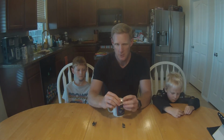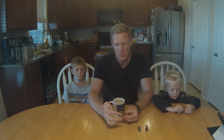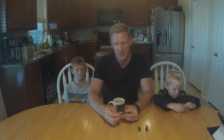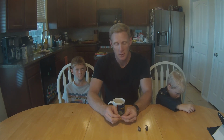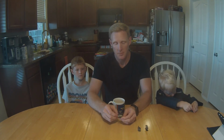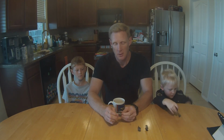So our first three we built like that. The next set that we started to build, I changed it up a little bit. Instead of welding one on there to make a T, I bent a 90 here and then welded a tab onto this side, so that at least one side of it is actually screwed onto either the rudder or the stabilizer, whichever one. No matter which part of the hinge, there's always something structurally supported. The big fatigue point is here, really, so that if the weld were to crack, it wouldn't depart the aircraft, is kind of the idea.